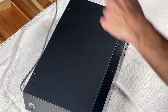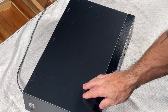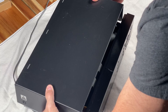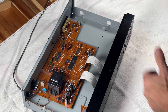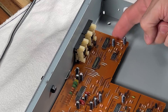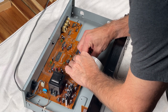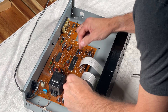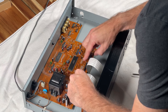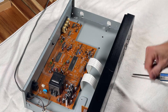Let's crack this thing open and see what we've got. I'm just using a simple Phillips head screwdriver to unscrew the four screws that hold the case top down. I'm going to be looking mostly at the RCA jack connection, which is right here. Next, I'm going to start disconnecting some of the internals. These ribbon cables, no doubt, run the spectrum analyzer, so those simply slide out. And this connects the external plug, so that gets disconnected too.